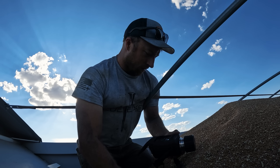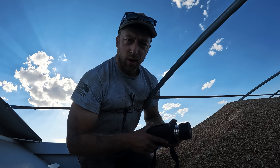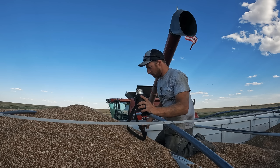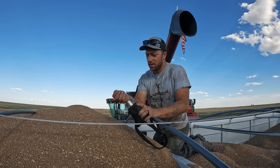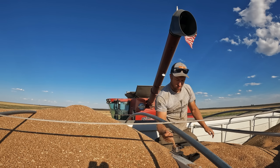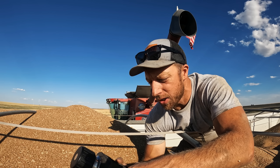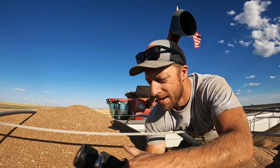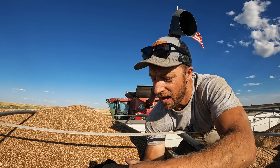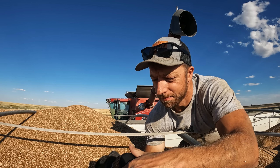Hard red winter — that's exactly the one right there. Testing... the verdict is 11.8% moisture at 87 degrees Fahrenheit. A little cooler than I thought. A couple more samples: 12%, 12.2% — found a little wetter. So out of three tests, I'd say 12% moisture at 92 degrees Fahrenheit. It's ready. I wouldn't mind it being a little bit drier, but let's keep combining. This will go in the bin — it'll cool down.